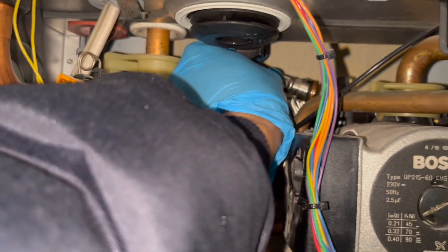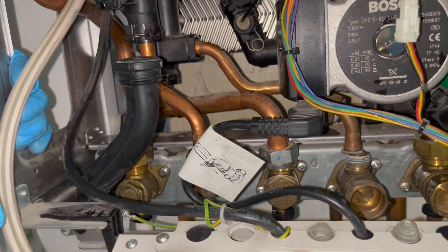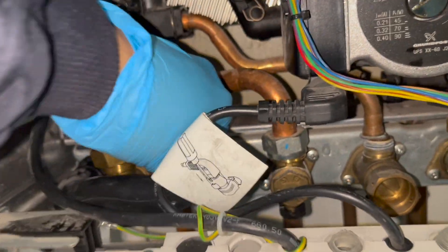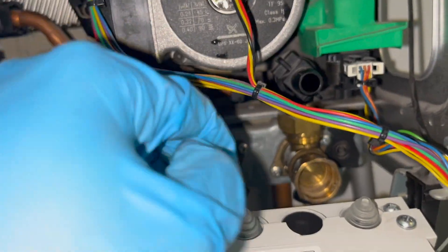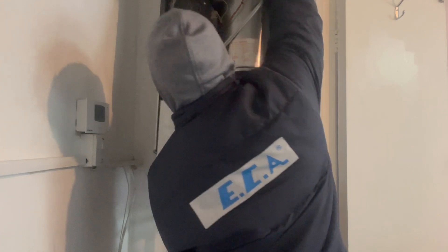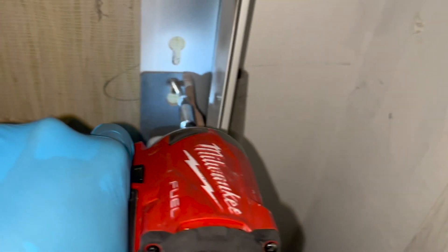At this point the expansion vessel part of the boiler and the actual boiler itself separate. I'm going to move the hose out of the way — you can see the boiler is ready to move, I just need to lift up on these nuts. Now the boiler should be ready to come off. What's left is basically the bracket. We've got two screws at the bottom, and we need to undo these five nuts so we can take the pipes away from the bracket. It's loose, pretty much ready to come off — just two more screws at the top.